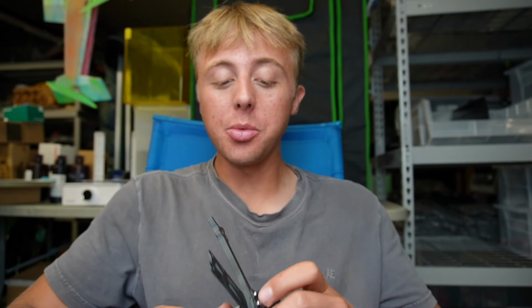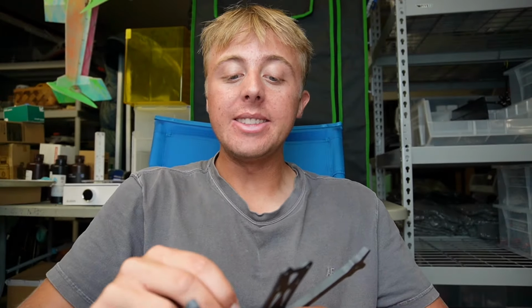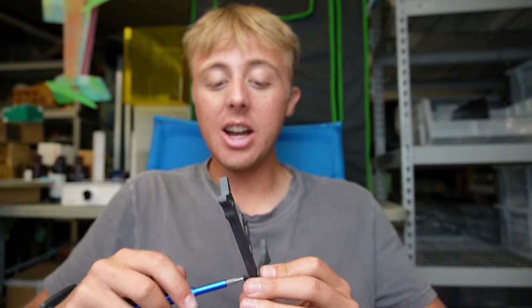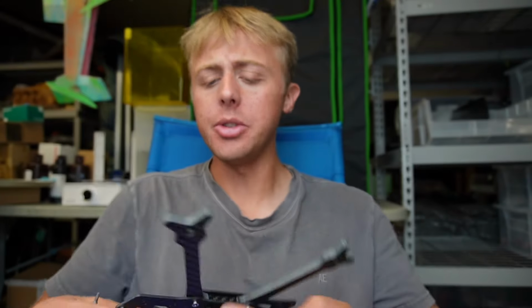Using your arm screws for standoffs like this eliminates hardware, which makes the frame cheaper, but it also makes it lighter, because if you add all these extra standoffs and hardware and all these things that seem like a feature, it actually just ends up with more screws to put together the frame, a heavier frame, a more complex frame. By simplifying it like this and making your arm screw a part of your standoff, it really simplifies and lightens up everything that we've had a lot of good luck with in race frames over the past few years.